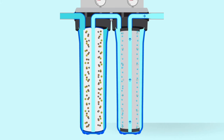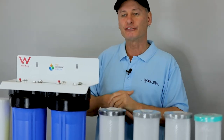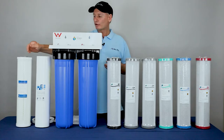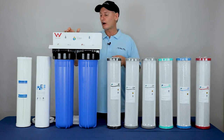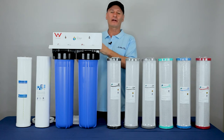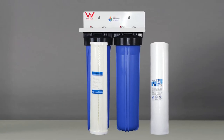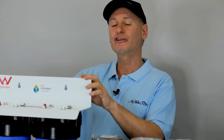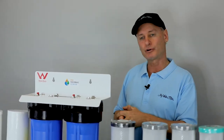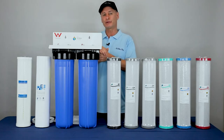These specialty cartridges are a lot more expensive than a sediment, so it's a good idea to have a sediment there to allow the secondary specialty cartridge to do what it needs to do. If you've just got quite sedimenty water and you just want to stop the dirt, you can put a sediment cartridge in position one and a poly-spun cartridge in position two — that'll give you a real barrier to sediment if that's your problem. Sediments can be hard to stop, but that will certainly put a barrier in between them.